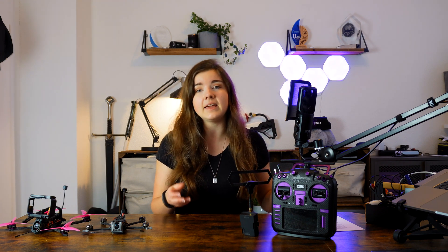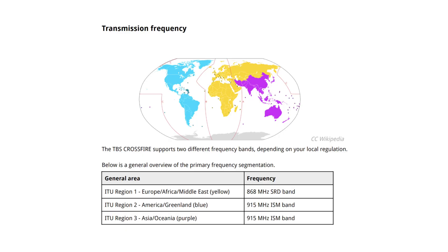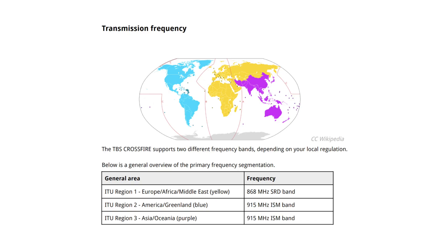Check your settings. This may not impact you as much if you're using Crossfire just for freestyle and long range, but back in the day — even half a year ago — I was using my Crossfire for both racing and freestyle. For racing there are special settings including a 'Race' mode at just 25 milliwatts, and changing those settings wasn't really on my list of priorities, which probably also contributed to the failsafe. As a quick cheat sheet: make sure you have more than 25 milliwatts, region set to Open, dynamic power on, and of course not the Race option — I'm almost sure Race mode was one of the reasons for my failsafe. TBS also claims it's really important to set the correct transmission frequency.